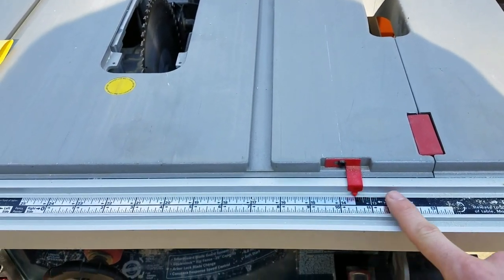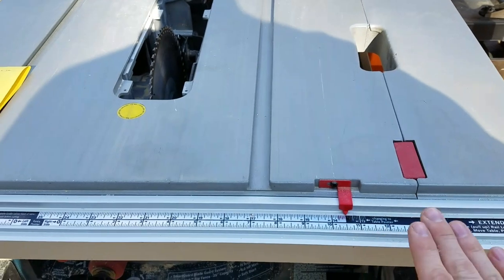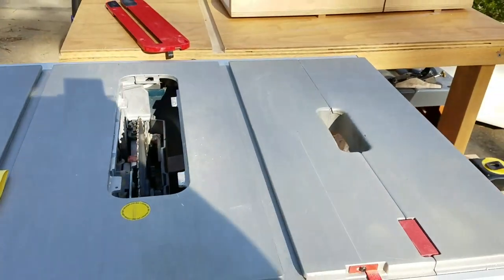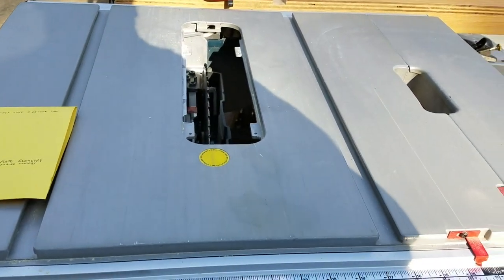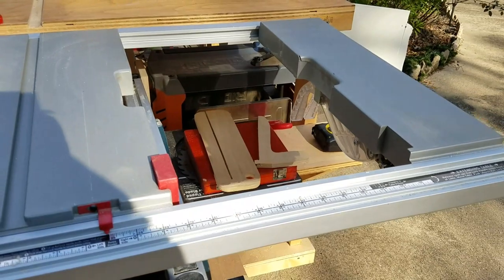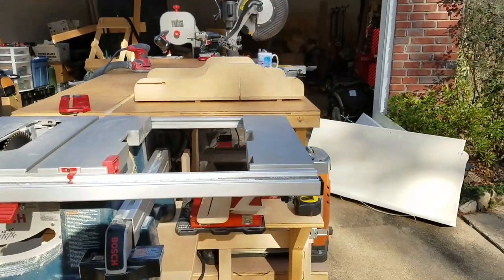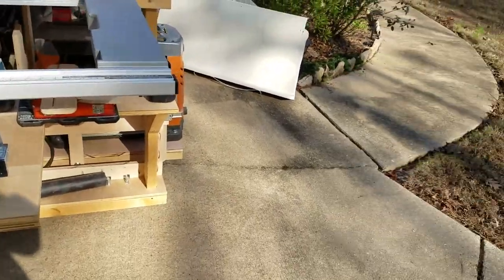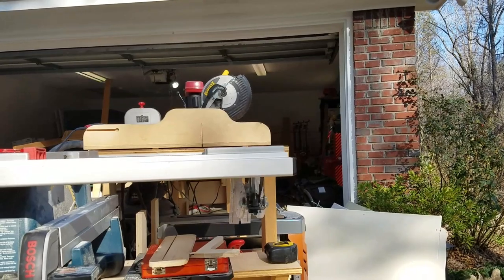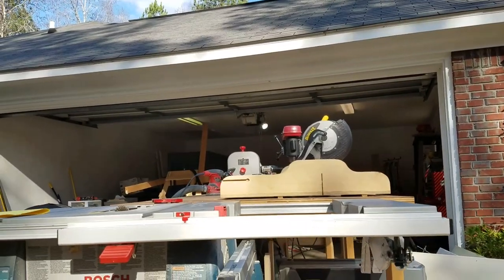All the gauges are fully adjustable from stock — I didn't have to make a single adjustment, and several years later I still trust these indicators. They make precise cuts; I can trust my fence position and don't have to check it with a tape measure. One thing I also dislike is that at the fully extended position there is a little bit of table droop, which is adjustable and I've made adjustments in the past. But now you can see it droops about an eighth of an inch down the table, and when you're cutting a sheet of plywood you don't want any corners catching on the outfeed at all.